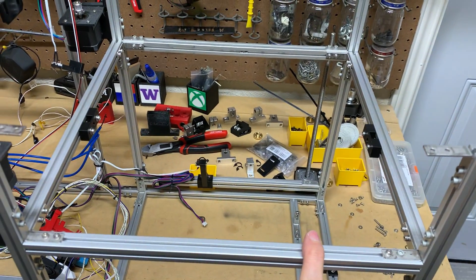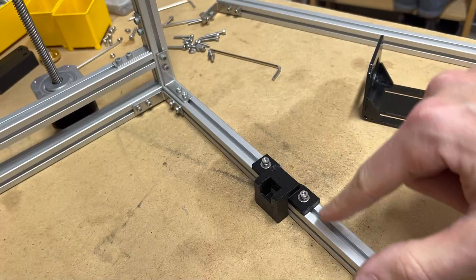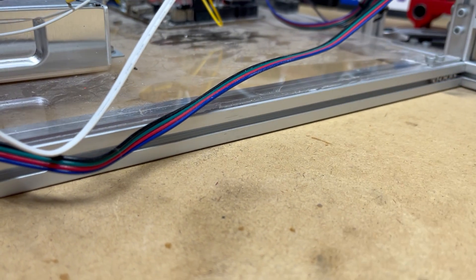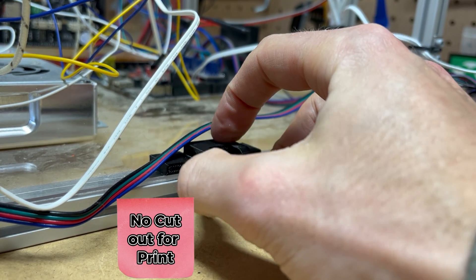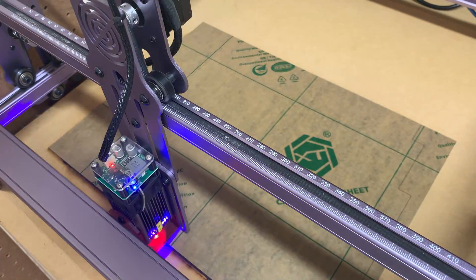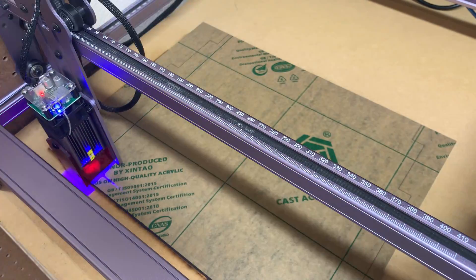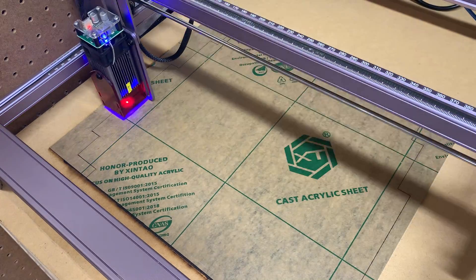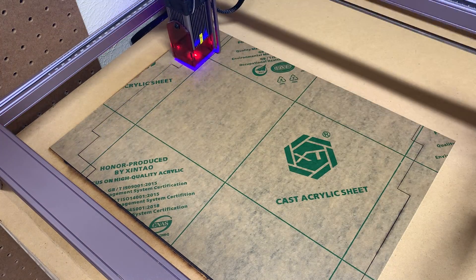That's a nice shot. Now you know I always get everything done perfectly and correctly on the first attempt — I just nailed the design, not forgetting about anything when I installed the bottom 3D printed mount, like PVC or nothing like that. Yeah... I forgot about the PVC sheet that was used to hold all the electronics in place. This print can't sit on top of this sheet and would need to sit directly onto the extrusion. So what to do? The simple solution would be to cut out a slot, or I could design and cut a new sheet using the laser cutter to cut a sheet of acrylic. I chose the latter.